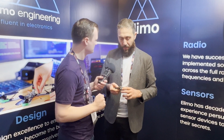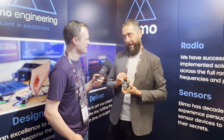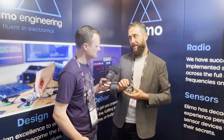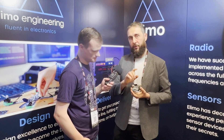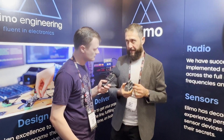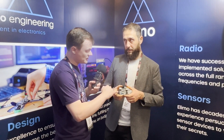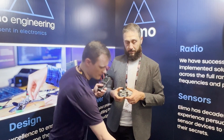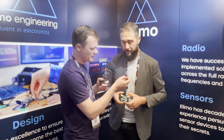So if you're a maker who wants to get into this, first step is to get the development kit and go to the GitHub page to get a builder's image. Interesting thing about all of this is that both the firmware and the hardware are open source. So you could get the schematics, get the gerbers, and make it yourself. That helps engineers and makers alike when integrating their own version, because the M2 connector is a very small pitch connector and not everyone wants to use a daughter board.